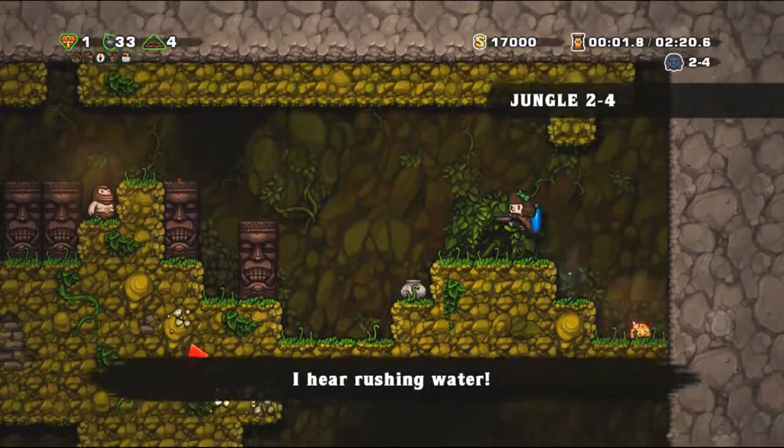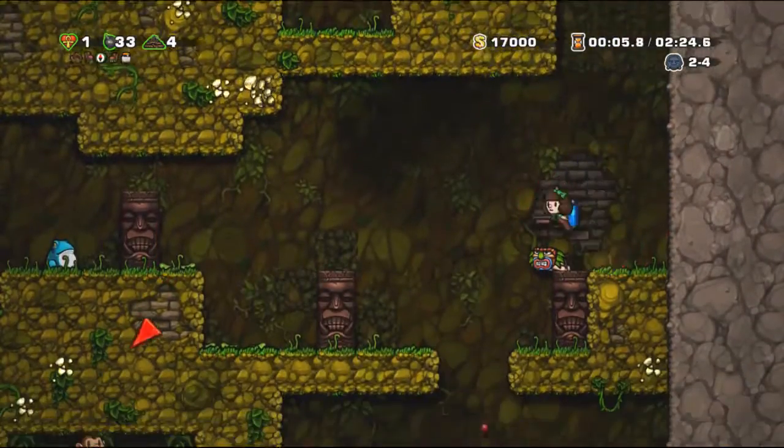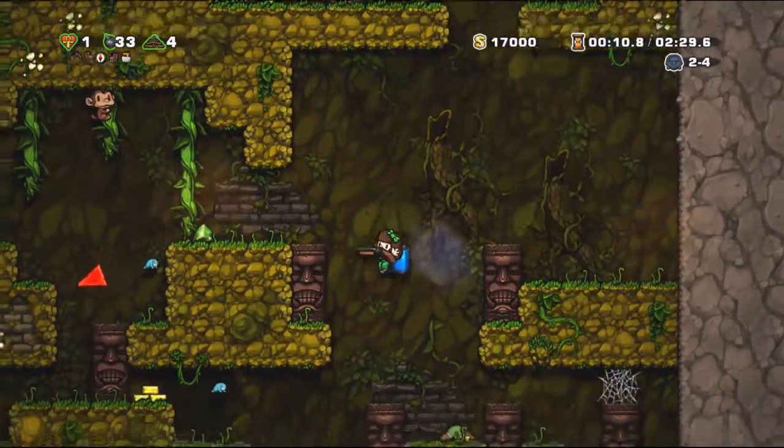I got the corners cut off of this piece, but it actually needs to fold up in two opposite directions. So I'm going to score this piece to thin out the material — because this is pretty thick — so that it will fold easier. Once we get it folded up, I'll go back and weld that corner to re-strengthen it.